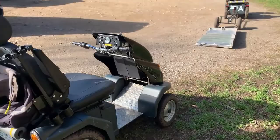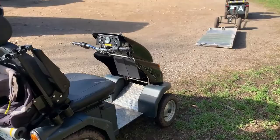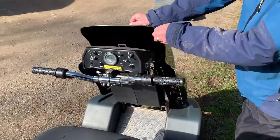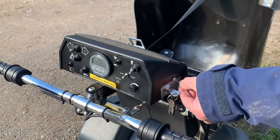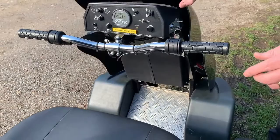So how do we put the tramper into push mode — how do we make it so that the tramper will push when it's not working? If it's still got battery, then we can do this: turn the ignition on, operate the push switch, and you hear the brake come off. It will now push with no brake.